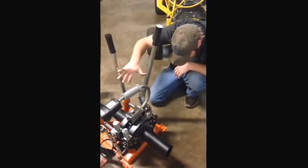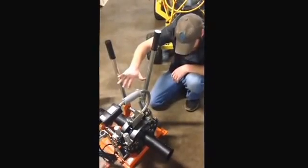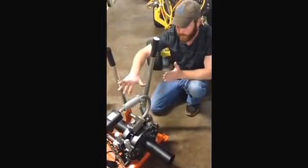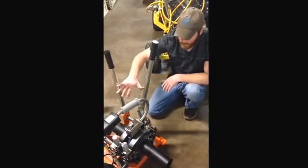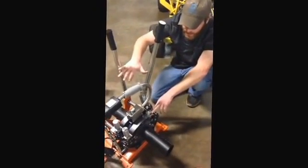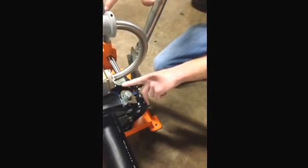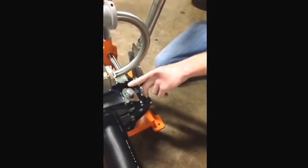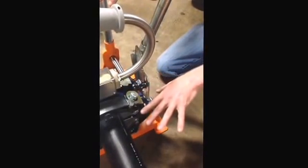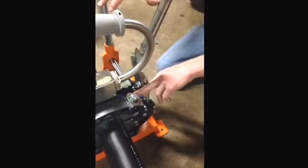Right now it's almost a 1/16th of an inch. It's probably got about another 30 seconds to a minute of heating time before I can open the jaws, remove the plate, and inspect the melt beads. One thing to note is this machine has a stop gauge that is industry exclusive. You can set this cam so that the gap represents my approximate final melt bead size once I pull the pipes together during the fuse. Right now I have it set at just less than 3/8 of an inch for this size pipe. When I do the fusion, I'm going to pull it shut until these two plates hit each other — that's the stop — and I'm going to hold pressure at that point. My melt bead has now gotten to the size I'd like.